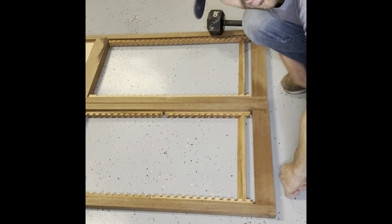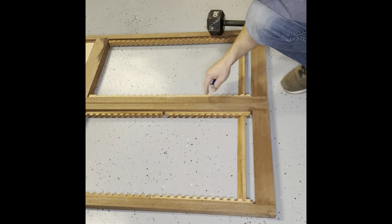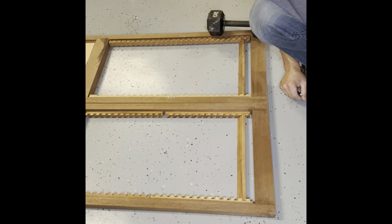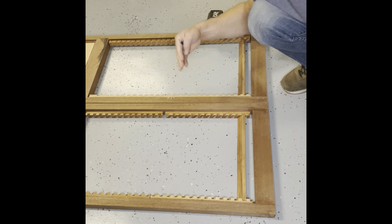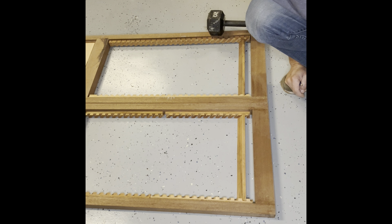I've made plenty of cove molding. Not all of it is 100% uniform, which bothers me a bit, but I have about 12 to 16 pieces and only need eight, so I can pick the good ones. Here's the stock for the top trim to go over the slats. I'm going to cut out just one section for the bottom panel to see what it's going to look like, then start gluing and assembling the door permanently — coming down the home stretch.